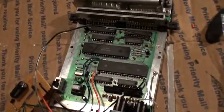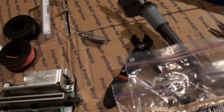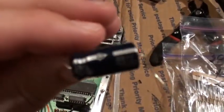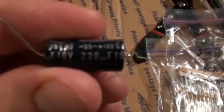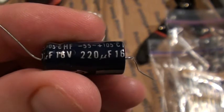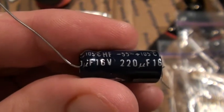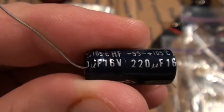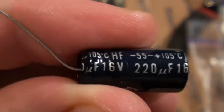You're going to make sure you need to buy four parts before you really start doing anything after you get your system. You're going to need a capacitor. You need to get the 220UF. Now the thing is, the NES uses 5 volts, and you can use anything over that. The program actually suggests 6.3, but you're not going to find a 6.3 — I never did. So I have a 16 volt.